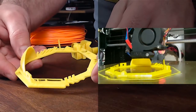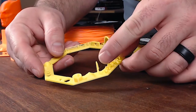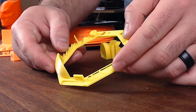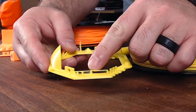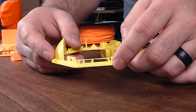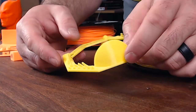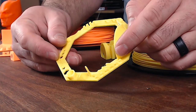This is a calibration test for your printer, but it's a really nice model to test things like bridging, how well it handles small details. This is called a spire — really small vertical prints — overhangs you can see here on the side, a hole in the side wall, bridging again. When you purchase a plastic, it'll tell you how well it bridges. In this case, MakeShaper PETG seemed to bridge fairly well. There's a little bit of drooping on the lower layers, but overall that's really not that bad. The surface quality is pretty nice on this dome. These little overhangs printed pretty well. All in all, I'm happy with this plastic, but I did notice a few things.